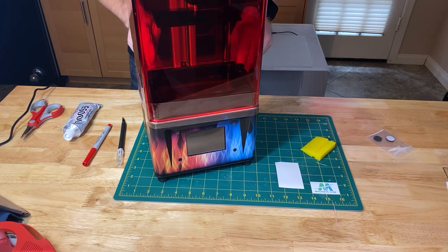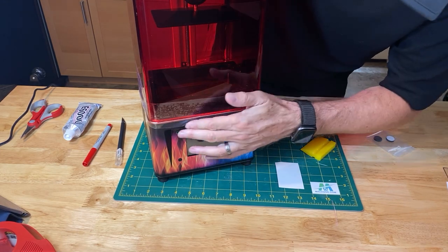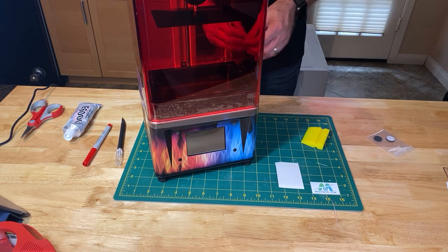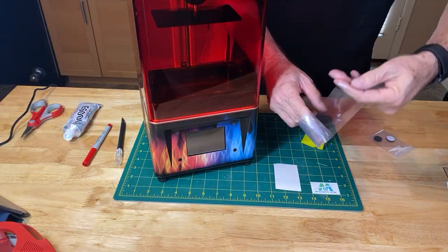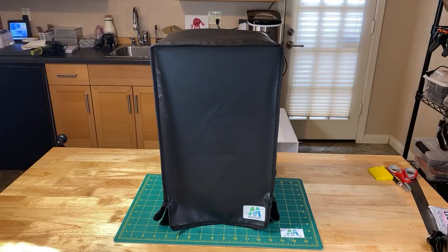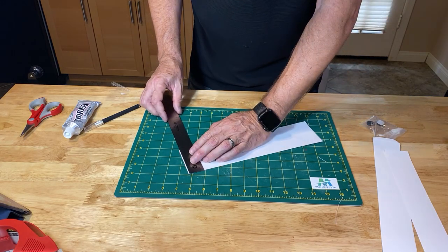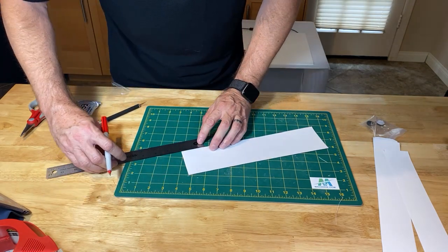As a side note, if you're interested in these flame graphics for the Elegoo Mars, it's a removable vinyl skin that you can apply to the front plate — I'll provide a link to that in the description. As you can see, it's easily removable and it can be rolled up and easily stored for the next use. If you'd like to add an extra barrier to resin fumes, cover the printer with a towel or thermal blackout cover. For those of you who are concerned about spilling resin on your touch screen, this static cling vinyl can also be used as a screen protector. I cut another piece measuring 1 7/8 inch by 2 7/8 inch to fit the Elegoo Mars screen and it's a perfect fit.